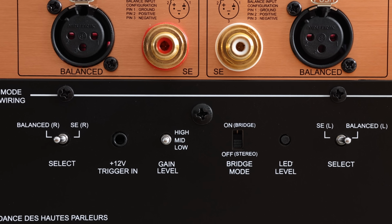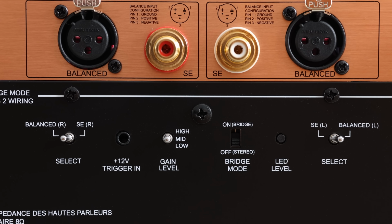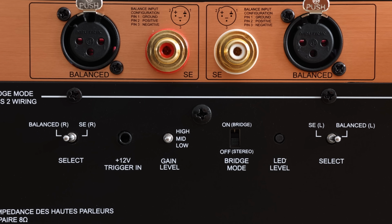And now you might be wondering why I favor the switch over the potentiometer. Well, the switch, in my opinion and from my experience, has the potential for being more correct. And what I mean by that is this. Potentiometers, although they can go through a continuous range, so you have many more adjustment levels than what a three-position switch provides, they almost always have channel imbalance problems. Old potentiometers in preamps, the left and right channel balance could be off by quite a bit sometimes.